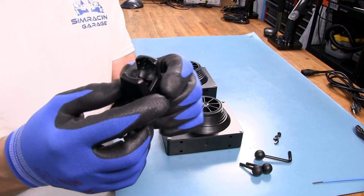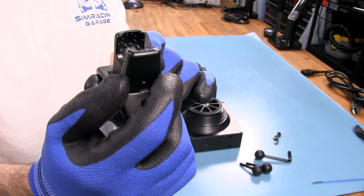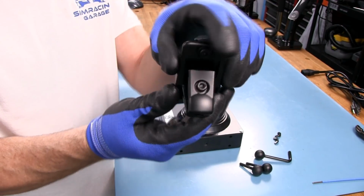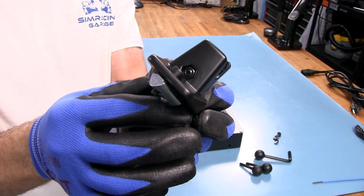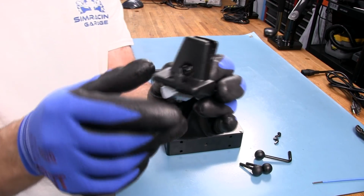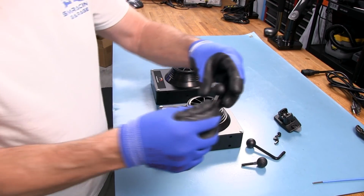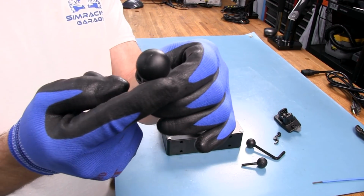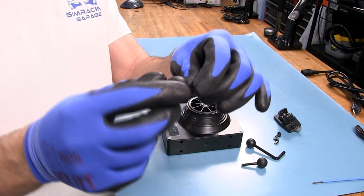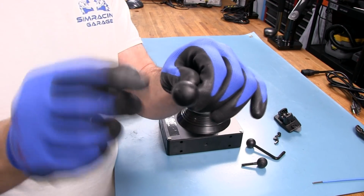The teeth inside of this thing is where the trick is and why it works so well. You can see they're actually spikes, very sharp little spikes in there, and we have them on both sides. And of course, we just adjust this down with this bolt here, where there's a little nut on the bottom. It gets secured in its own little shaped container there, so it won't spin when you're spinning this guy. And that will be clamping down on these pieces here. Now, this is a hard plastic ball on this, but it's not so hard that it won't accept indentation, so it will allow the teeth to grip it. In other words, if it was too hard, the teeth wouldn't get a good grip on it, so the teeth are able to sink into it a bit.